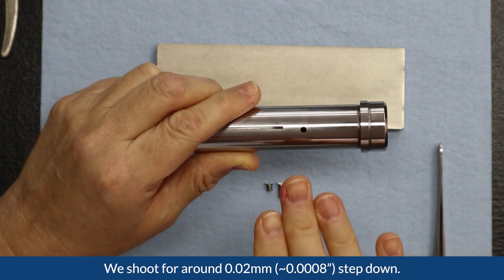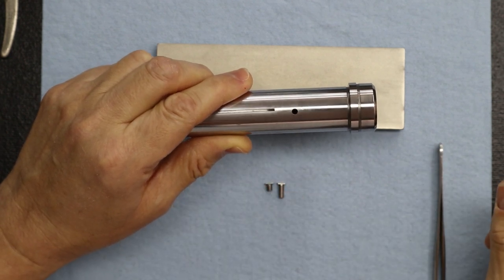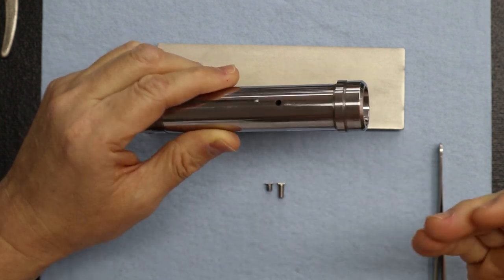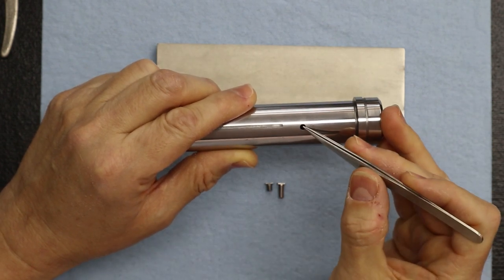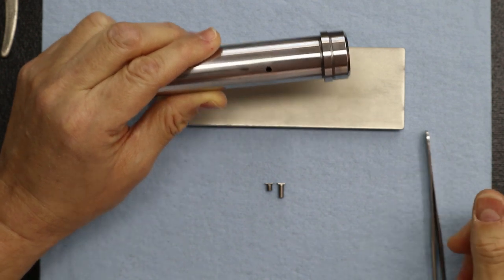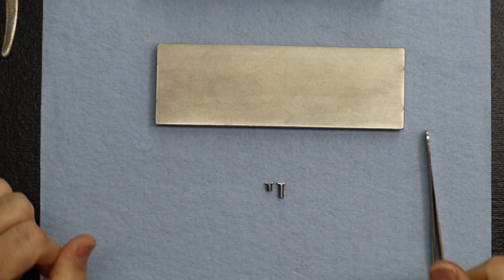step right there. Step down, so there's no interference with the bearing installation. That's correct. And you'll see, if you happen to disassemble a Levin spindle and it already has a key, you will see that little step. So it's a little step down, okay? That's what Levin does, so we're obviously going to follow the same method they use.